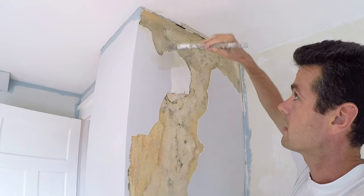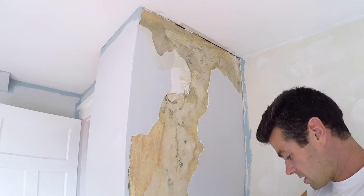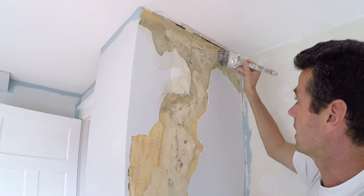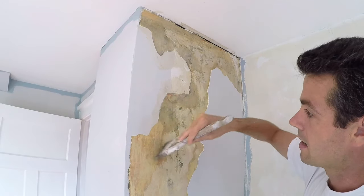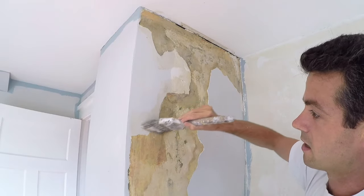There's been water damage that's made it delaminate. I can feel this stuff skinning over pretty quick. I'm just making sure to get it under the edges more than anything — it's not even the broad surface I'm worried about. It's just under the edges to make sure that that stuff all gets held down, and I don't get loose spots and blisters when I put my coat of quick set mud on.